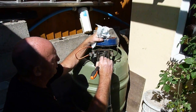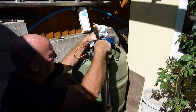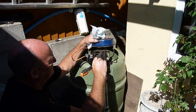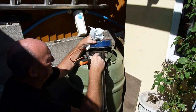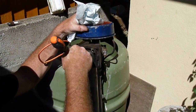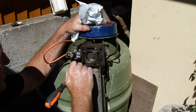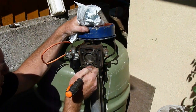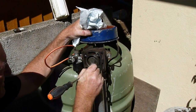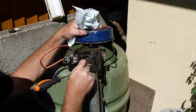Now we need to clean out all of the ports on the outboard. You'll find a lot of carbon, so use a screwdriver and give them a good clean. This is a great opportunity — it will help your Seagull keep nice and pure in operation. The problems with the outboard, of course, include overheating, and carbon will build up and can crack parts.